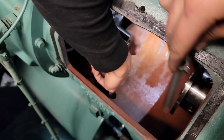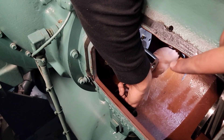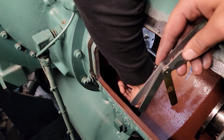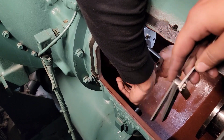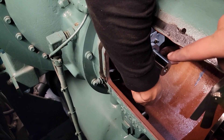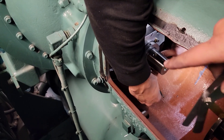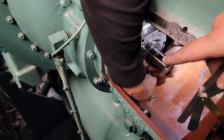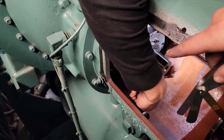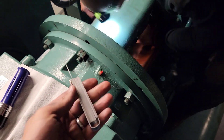In this next part we're using feeler gauges. He's bringing those shaft Allens in just enough to where they touch, and we'll get a baseline to see if it's even all the way around and where we need to make adjustments. You need to get that center ring as close to perfect center as possible. If you have a wider gap on one side, loosen and tighten those Allens until that ring is lined up just right. That's going to go a long way in helping this seal last longer and perform correctly.